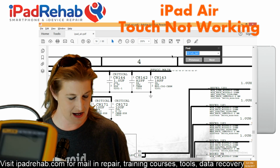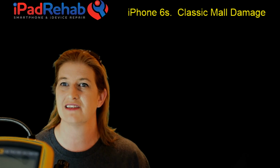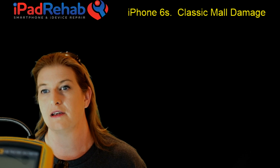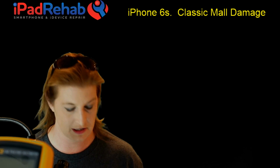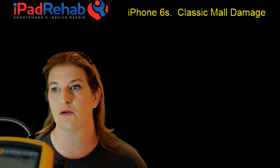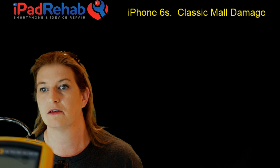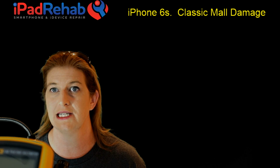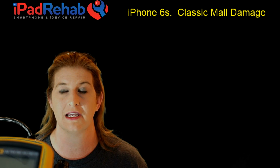All right, but our line was PP1V8SW2. So let's get moving because I forgot I need to go pick up the CSA. We care about PP1V8SW2. Why? For those of you that are new, because it turns into PP1V8 grape. PP1V8 grape goes to a bunch of places, including this little logic gate chip. We know VCC main grape is present. Ding. We know that PP1V8S2R grape is present. We know that this signal from the PMIC is absent, and we know that the output is absent.